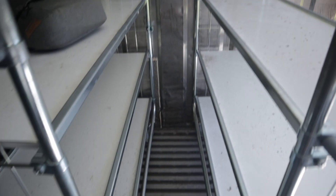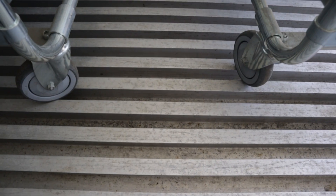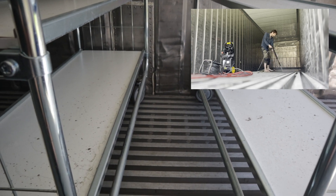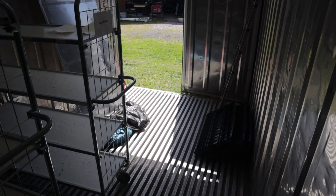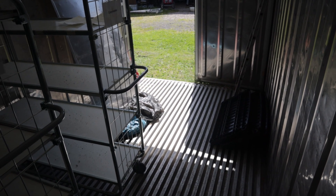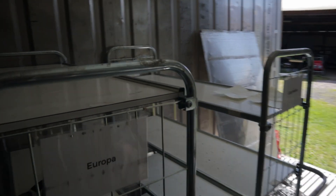At some point I'll need to partition this front section. I have stainless steel tables which are 165 centimeters long. I think I will allocate the first two to two-and-a-half meters and put a wall in somewhere around here, maybe in between these shelves. I've looked into some steel framing for partitioning walls. I'd quite like to leave the corrugated floor because, as you may have seen in my other videos, pressure washing and air blasting it is very handy for keeping clean. If I were to partition this section here, it would leave me a couple of meters of working space for harvesting, sorting out mushrooms, and all the power, humidifier, light switches, timers and water can come into this partition section. Then I can have a door coming through into the fruiting chamber.